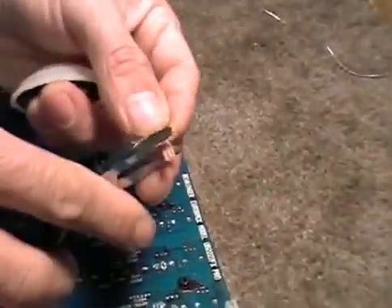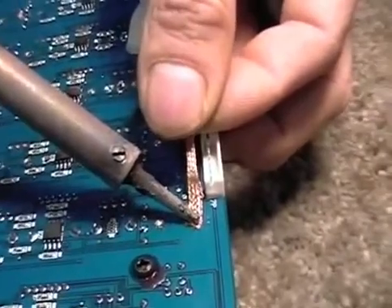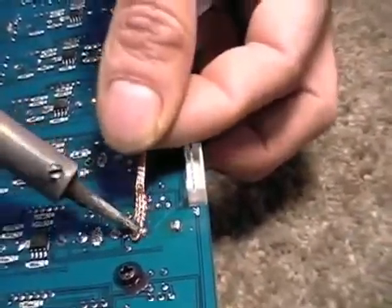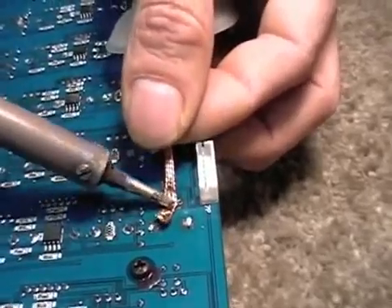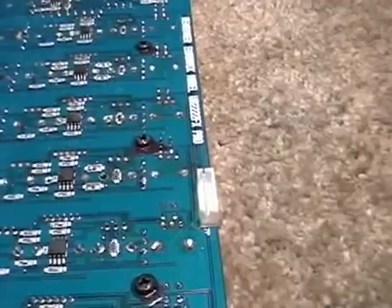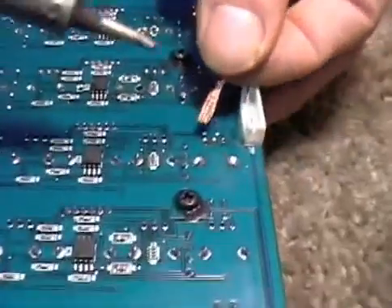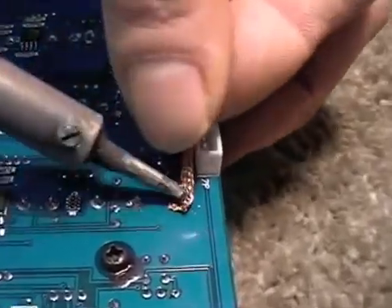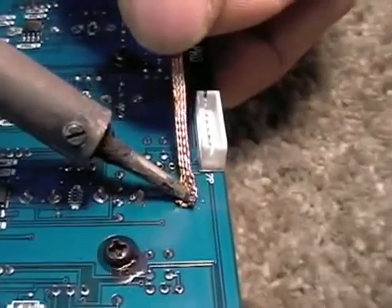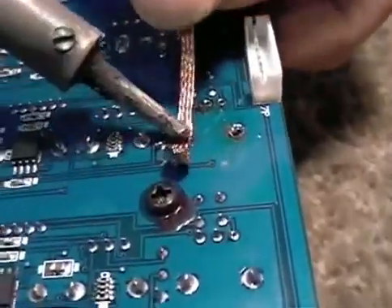This is pretty tricky. Scribe it a little bit, expand it a little bit. Lots of heat. Snip it off. There's two. Solder wick. It helps if it's fresh. If not, you need to scribe it to try and get some of the oxidation off it.